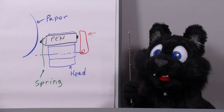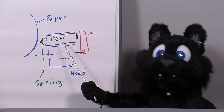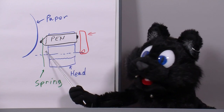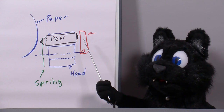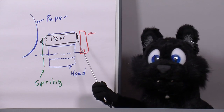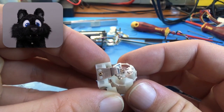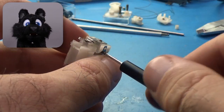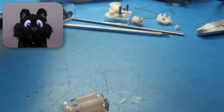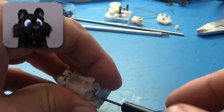And here's where I discovered the third issue. The printhead, which holds the four colored pens, has a tiny little metal spring on the front that pushes the pens away from the paper, and is overcome by the pen-down mechanism on the back side. The problem with it? There was a chunk missing! The plotter wouldn't work properly without that, or at least not with all four pens! Another spare part to remake!